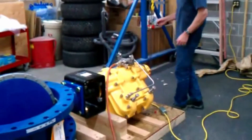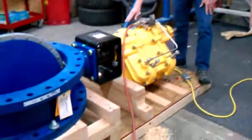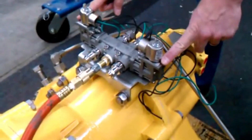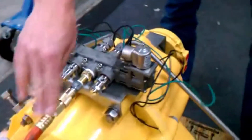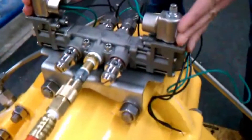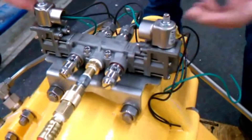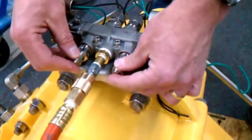The way we do that is by putting our air supply into this device here. This is a dual acting four-way solenoid valve, so we have our air supply. We've got two coils — one that'll open the valve, one that'll close the valve — and then the exhaust comes out here, which is adjustable.